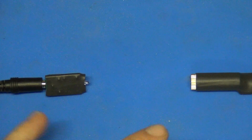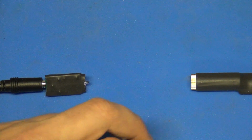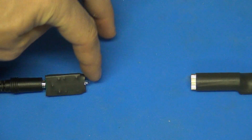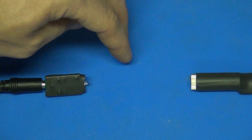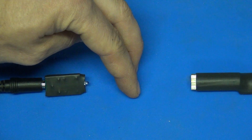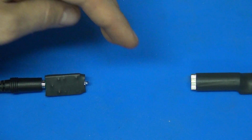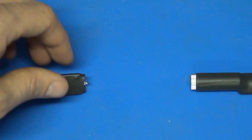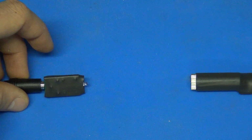But there's three issues that I've noticed when configuring these as a laser trigger. And basically when I say a laser trigger, what I'm talking about is the laser is shining on the light sensor, and so the light sensor detects a bright light constantly, and then when something moves between them, that bright light is blocked, and you can use that drop in the light levels on the Camera Axe to take a photograph. And a lot of times people are doing that kind of work outside, so you typically want to enclose these in something that's a little more water resistant or weather resistant.